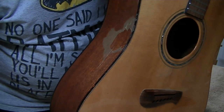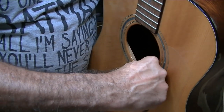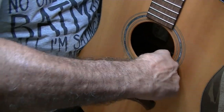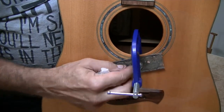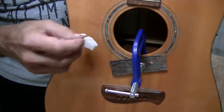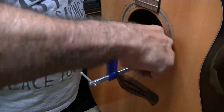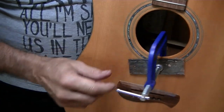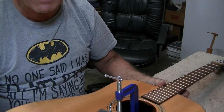I can also get behind the end of the brace where it's lifted and glue that too. Looks pretty good — you can see the glue is all the way through. I can squeeze it together and pump it, and I can see the glue pumping through. Now I'm just going to wipe off the excess glue and then clamp it up. I've got a piece of leather on the top, and the clamp itself has a little piece of leather on it too — a double pad. The clamp on the inside has leather as well, just to avoid crushing the brace. We've got it cleaned up real nice; we can let that set for a few hours and we should be good to go.